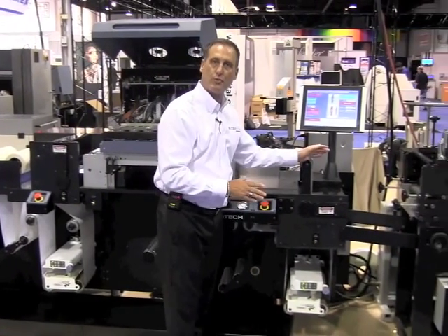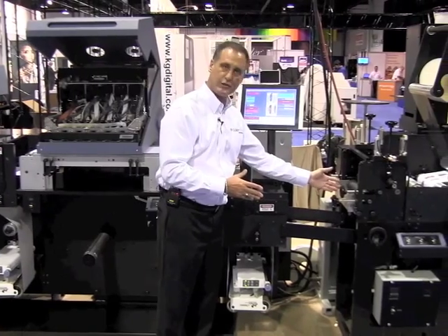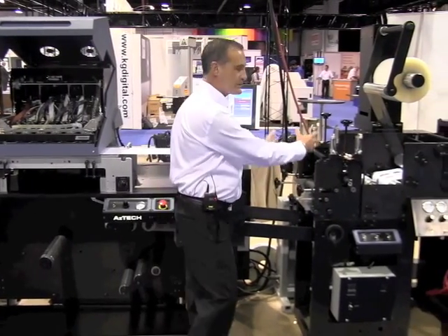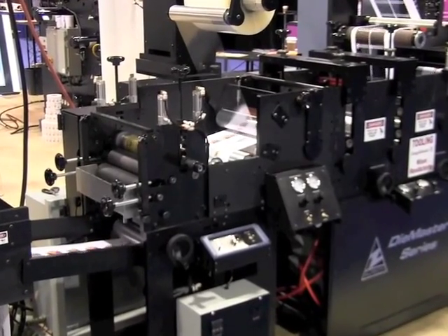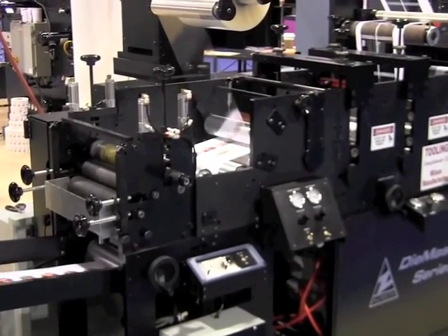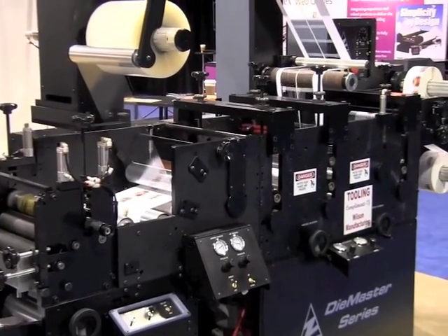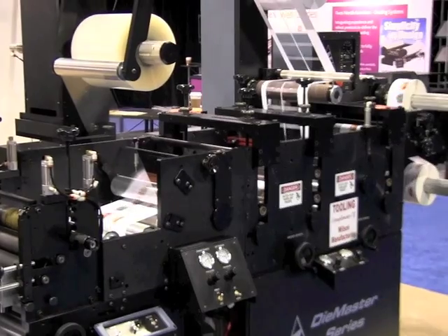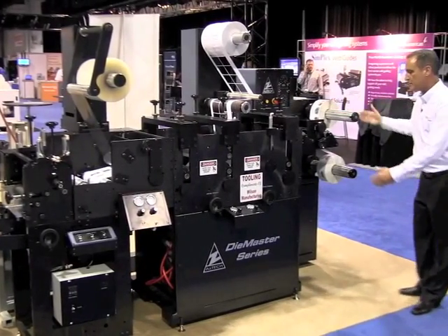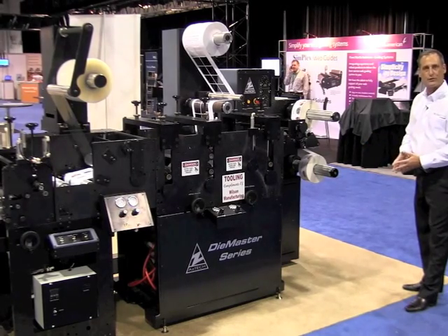This unit is also available in our Pro model, which allows us to attach a finishing station with a full flexographic station for varnish, static print, or UV coating, a lamination tower to provide lamination for water resistance, and three die cutting stations for finishing as well as slitting, with the ability to also add a jogger or stacking table for sheeting options.